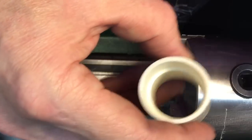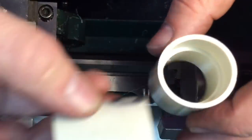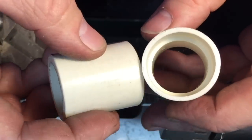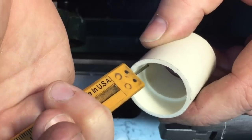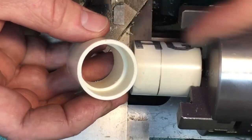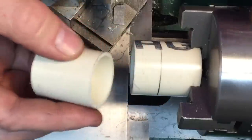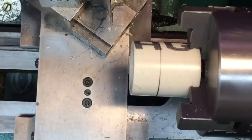You can see what we made here — basically all we did was cut out the inside here, see that, and made a nice little shoulder. Now what we're going to do is cut the outside of this so it slip-fits in here — and that'll be our exercise. The first thing we want to do is make the shoulder to the right length so it bottoms out on that ledge. To do that, we take any depth gauge like this, push it down to here, read it, and scribe it over on the other piece. Now, depending on your skill level, you can measure with calipers, or we're just going to take a little bit off at a time and try and snug fit it on. This is where it gets fun — it's all practice, and it will get you better at the lathe without dealing with expensive or hard-to-work-with metal.